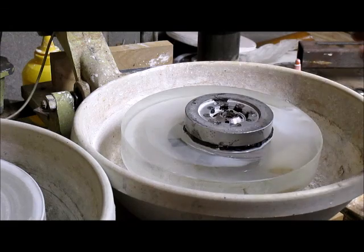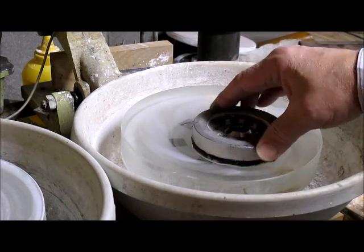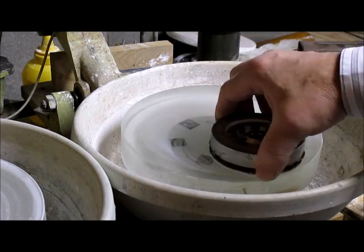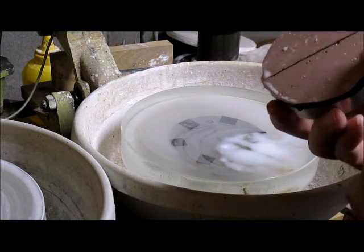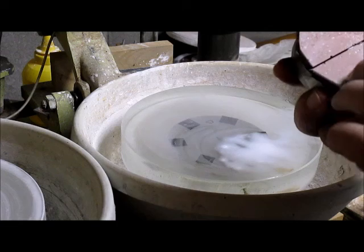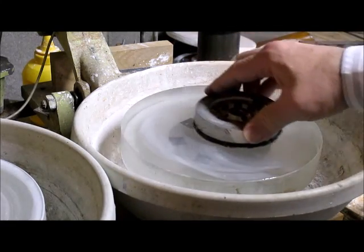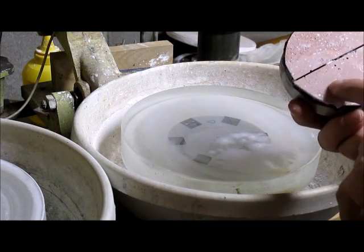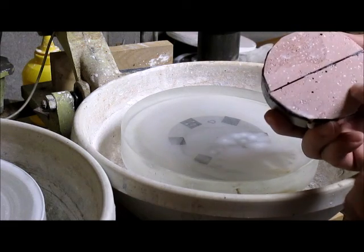After an hour and 27 minutes of polishing, the mirror has become more and more aspheric as I approach the parabola. A regular pitch lap will start grabbing because of the asphericity — it doesn't run smoothly. One thing I'm trying is putting LP66 on my lap. I rubbed acetone over the top of the pitch to make it sticky, pressed the LP66 down into the holes where it stays on really well. I've polished thousands of optical lenses using LP66, so it gives a very smooth surface. It's not the same as the Pellon pads that a lot of ATMs use — this is called LP66.